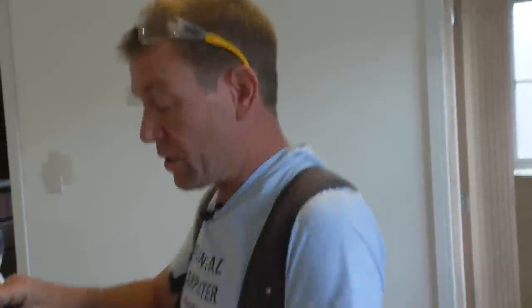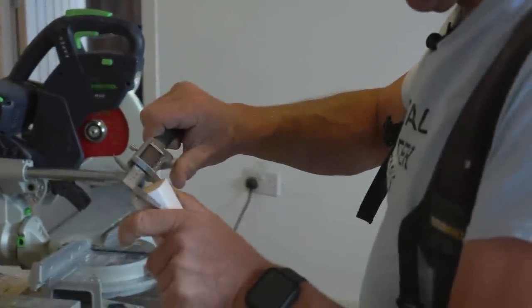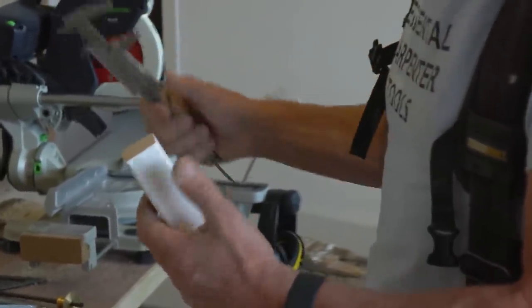I'm going to try and get it — I've got some of these and the sticks vary, not a lot. They're saying it's 32.3, it's 32.6, but some of them are just under — that's 32.01. I'm just going to call it 32.5 for the maths. It's 32.54, so it's so minute. I've got 25 sticks coming through there, so I'm half a mil out every stick — that's 12 and a half mil out at the end. I want to try and get the spacing. That's half a stick out. So I want to call it 32.5mm for the maths purposes.